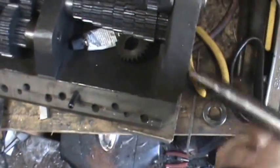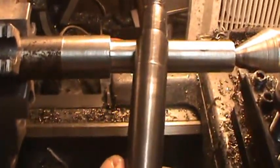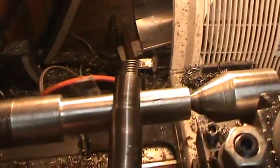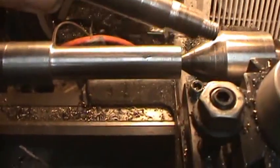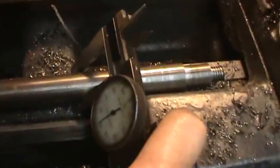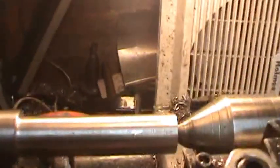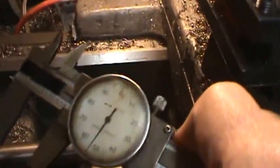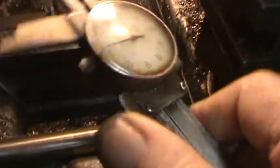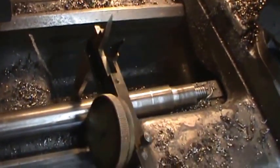But rather than try to use this shaft, which was good enough, I need to adjust the dimensions and everything of this, and that's what this new one is going to be. This shaft here is 3/4 of an inch. Let's throw a caliper on it there. It's 755, and this one also looks like it's about 755. Yeah, but this one should be 750.